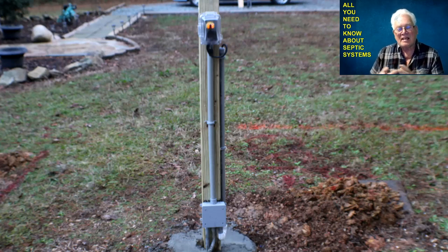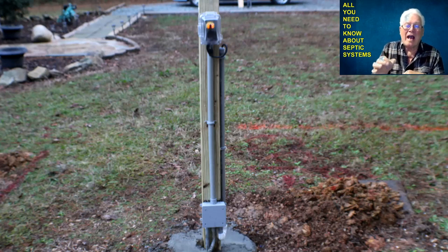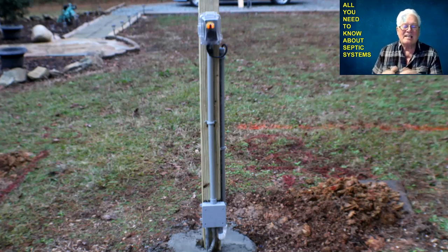The first thing I did was buy a four-inch by four-inch junction box — you see it at the bottom of this post. The post itself is a four-inch by four-inch pressure-treated post from Lowe's, about five bucks. You put that into the ground, dig a hole around it, and pour cement to make sure that post never moves. Then I added that four-inch by four-inch electrical box with four screws on its cover. I brought the main electrical wiring from my house down to the pump and back up, and put the wiring into that little four-by-four electrical panel.